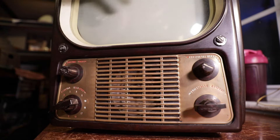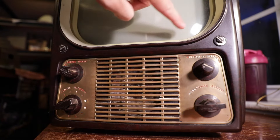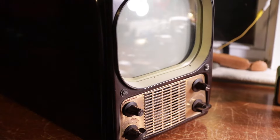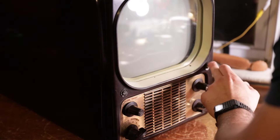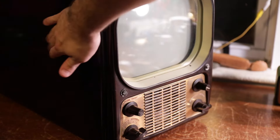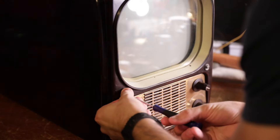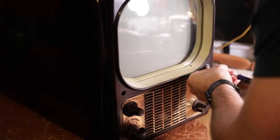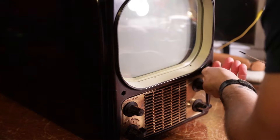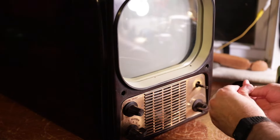The front protector screen looks good, even the little yellow bezel up here — the CRT sits right behind that and it looks good. I looked at the schematic and it turns out these do use a 10BP4 picture tube — great news. I assume this back portion disconnects from the front. Going ahead and trying that... these off... maybe it's just the front coming off. I'll go ahead and take the knobs off and put them somewhere safe.